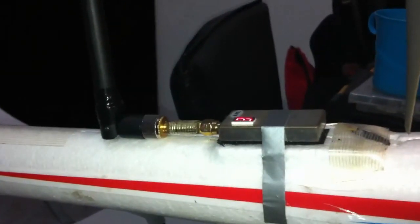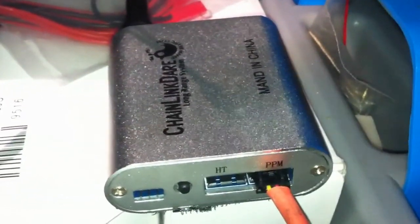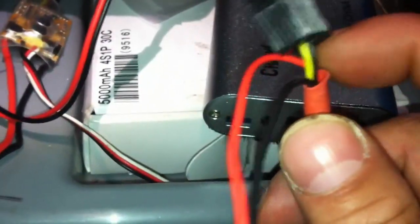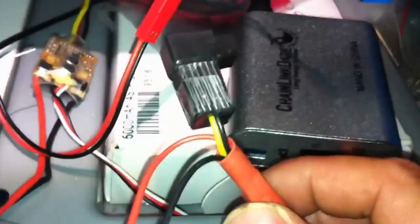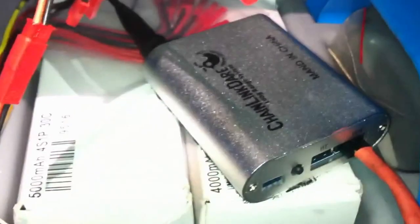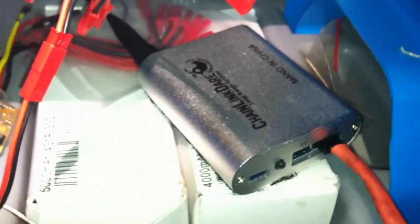This is the 800 mW 900 MHz chain link receiver. I'm using the Futaba right now, but I used this chain link receiver and transmitter before — the new one. It really burned and fried my Futaba 7C because the power coming out of the Futaba port is not 12 volts, and this needs 12 volts. So if you plug it in, please do what I am doing — I took out the red cable out of the plug and shared the ground. I made a connector and I'm powering the chain link transmitter with another external 12-volt battery. It's working, it came back to life, it didn't fry.